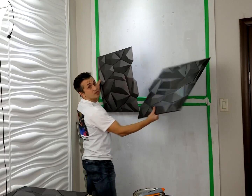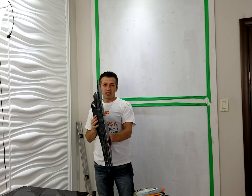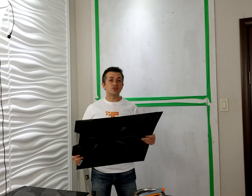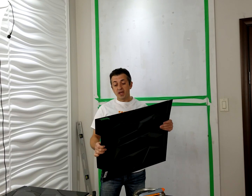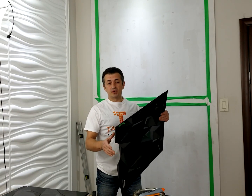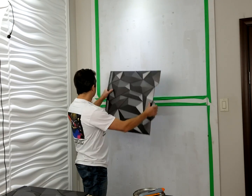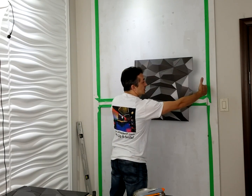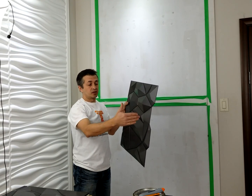Now, since this panel is fairly deep, it's at least 1 inch, I would recommend to try to avoid the cuttings as much as you can. The only case basically when you cut the panels, it's when you run wall to wall. So you start from one side of the wall, and when you run to the other one, you cut it and you butt against the perpendicular wall.